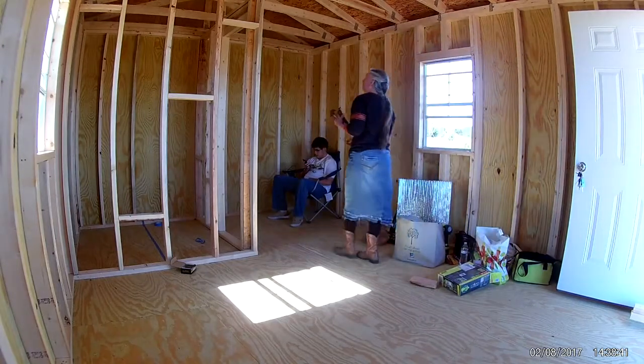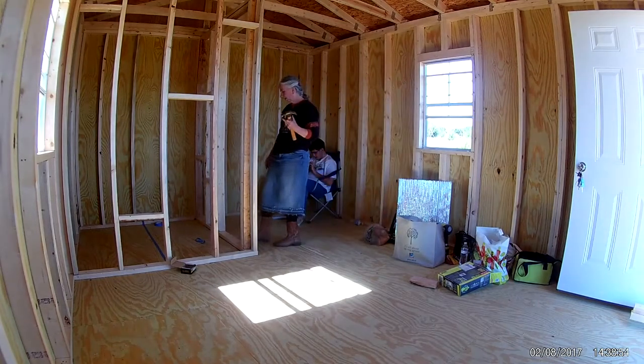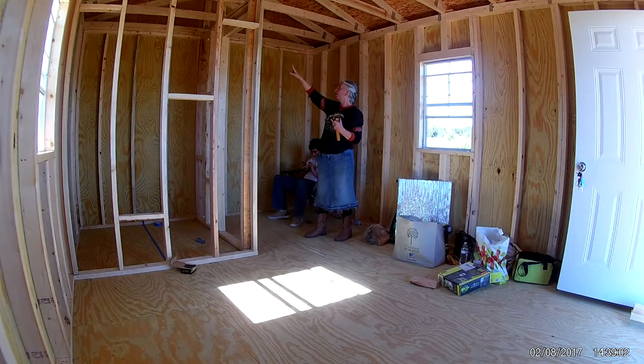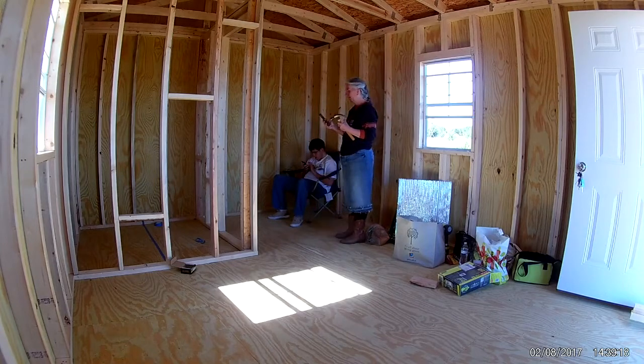It actually fit. So like I said, once we get the top plate in, I've got it only secured to the one side over here, so I'm going to go ahead and secure it to the floor on this side, and this part will be cut out for the entryway, for the doorway. And then, like I said, I'm going to put in some more 2x6 bracing up here, so that when I put on the rail system for his sliding door, since it's not going to be a big sliding door, it shouldn't be a big deal, but better safe than sorry, right? All right, here we go.